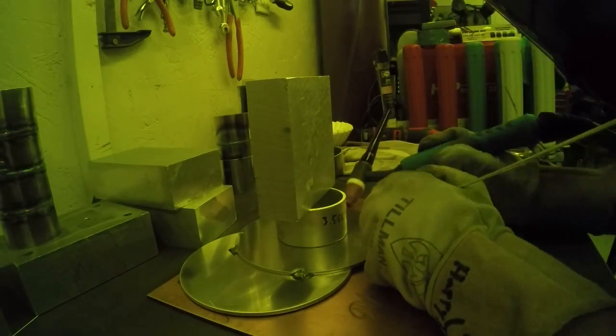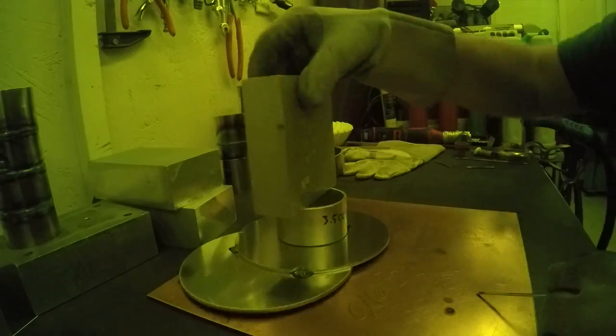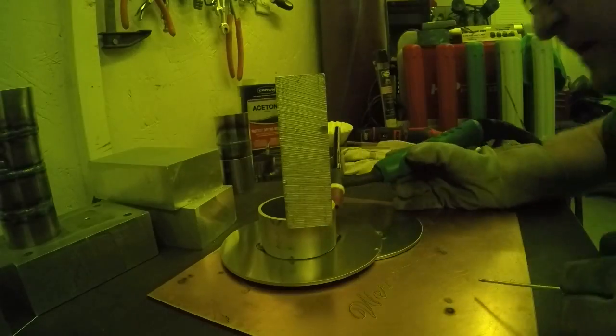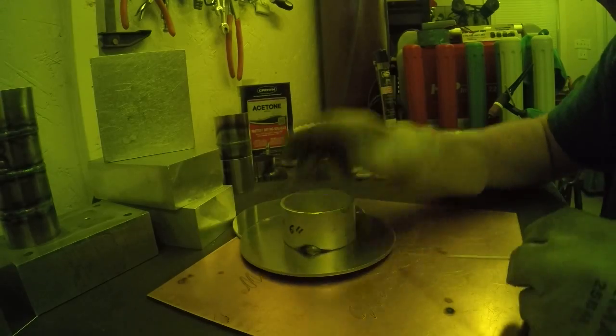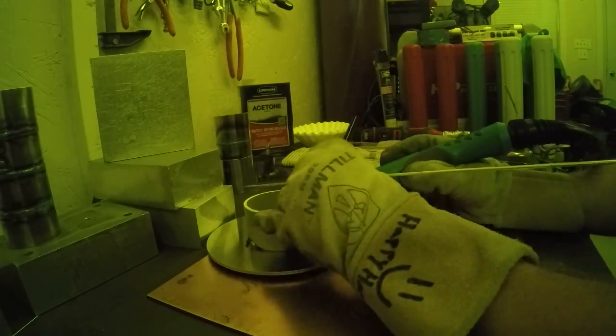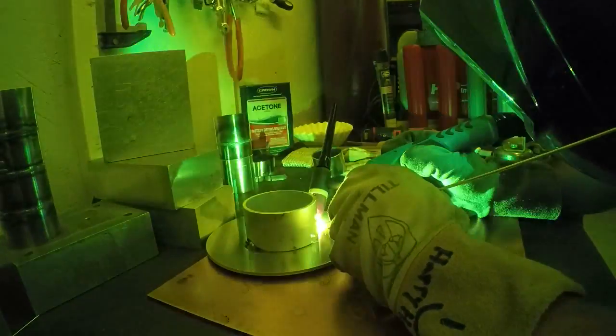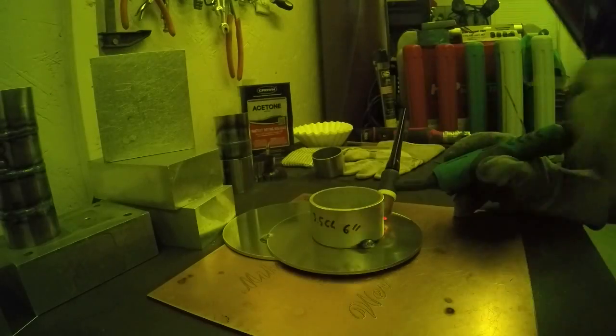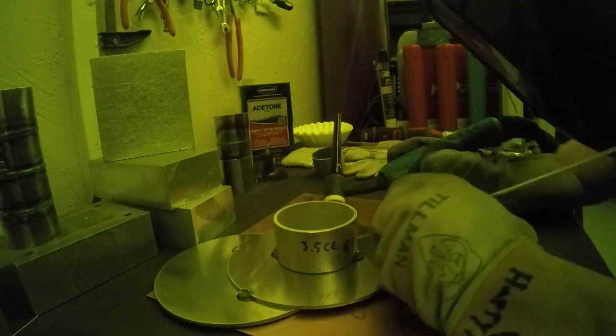On most of my stuff I do on my AC machine I'll use 1/16 for pretty much everything. We're on straight argon at about 180 amps — I settled on 170, tried 160 and 170. This is my first time welding aluminum on DC. When you weld with AC, the AC does its cleaning action and burns off the oxide film — it gets shiny and wet. With DC it doesn't do that. You just put heat in and there's no visual cue for when to add filler.